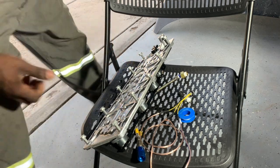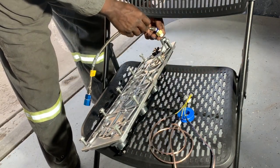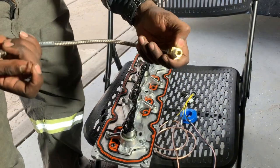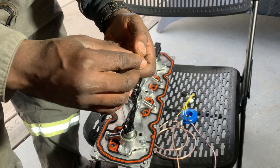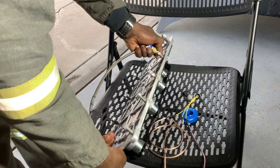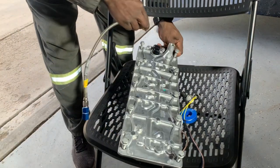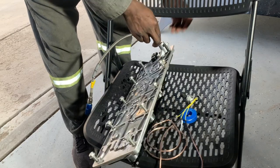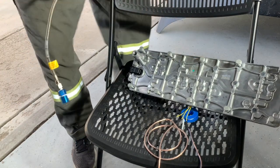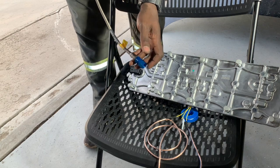I'm going to replace this anyway. Since I've got this here, I'm going to go ahead and get this in. Make sure when you put this together — I already put the plumber tape on there — you include and don't lose the compression ring. Flip her over and put this on now. This came with a filter already in there, so I don't have to worry about it. This is deep enough where the filter can go in so I can change the filter as well.